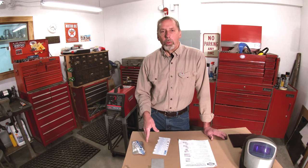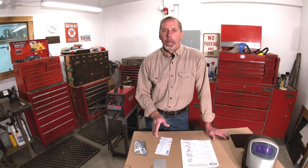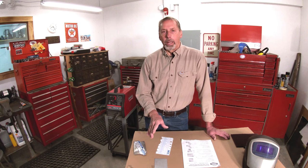Then they got better. The last time I took it, the instructor would come to the shop and you would actually use your welders at work. At the place I was at, we had three different welders — everybody had their own preference. So you're used to your welder and you're going to test with the welder you've been using, which made it a whole lot easier. Plus the instructor would actually go step by step and show you how to set your wire speed and heat settings. I had my preferences for vertical, overhead, or horizontal at different metal thicknesses, but it was funny — somebody else would grab the same welder and change the settings completely, and we'd both get good results.